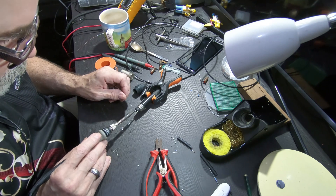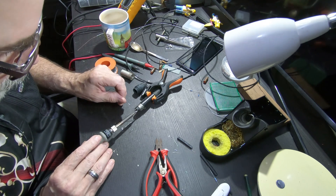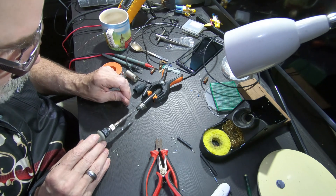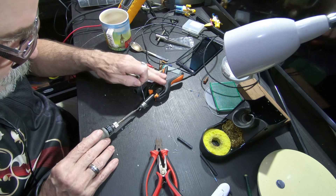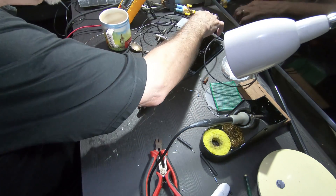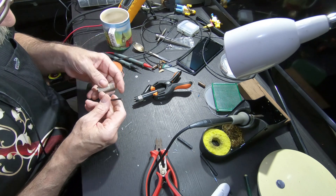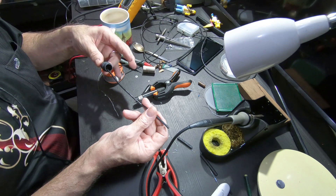If you're only doing this one at a time, a female XLR and a clamp works fine. If you're doing a whole lot — if you're wiring a studio and need to wire a whole bunch of cables — drill a hole in a two-by-four and put a panel mount female in there, then just plug them in, female to male. You've got the best of both worlds and you can just solder away, cable after cable. There's a nice little bead there. Now let's take the other side of the wire — this is the output. Get this end and prep it. This goes on first before we do anything, before we strip or anything. This is going to go on over that — thread it on.